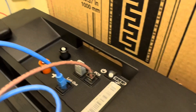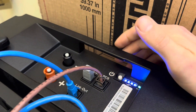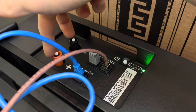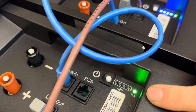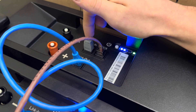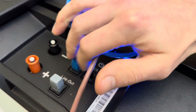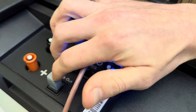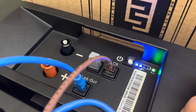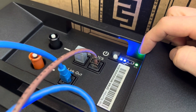So this is the battery right here. You can turn this on, and it'll blink, go through its boot up, get voltage to the terminals. You've got a second one here — your primary battery here with the dummy plug, which means this is the primary battery. You link the batteries in parallel, and this one is the last battery. You can have a bunch of batteries in between — I believe it's up to 16, but we haven't fully tested that yet. Green light means everything is online.